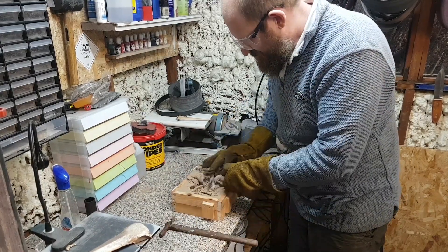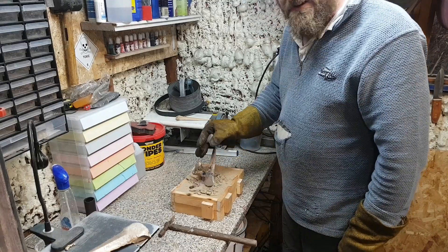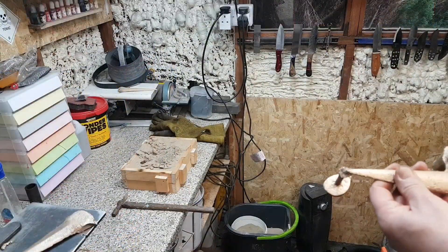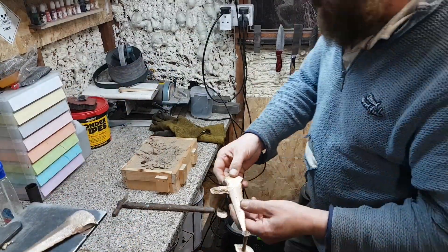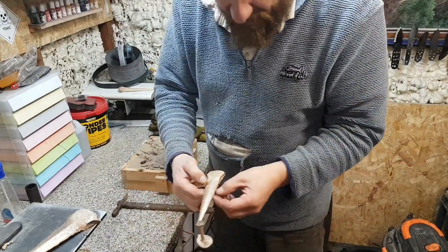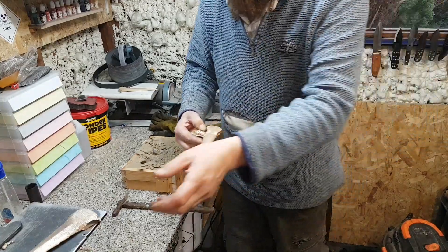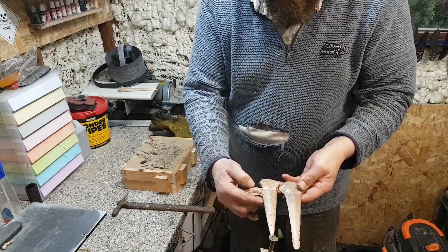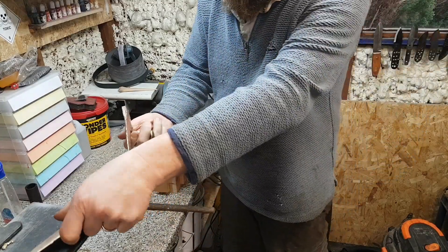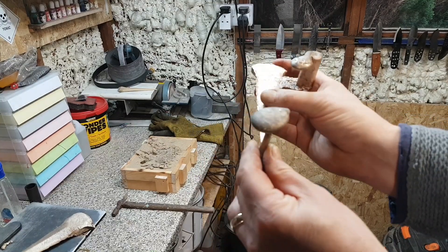What do you reckon — looking promising? Well, hello yeah! Hey look at that — let me just get that in the water because it's burning my hand as we speak. As you can see it's pretty hot, very hot. You ready guys? Now look at that. That is fantastic isn't it — that was the second one. Now the only thing we've got is we've got this pitting and we know why that is — it's because we weren't dusting fine enough. But as you can see the detail on that third one is so much better — I've even got the square edges here look. And on the back side, if you can catch the light you can see we've even got that detail on there.